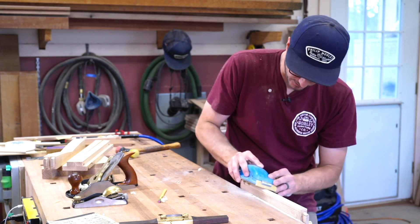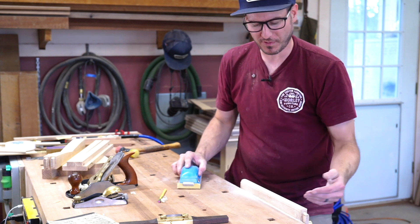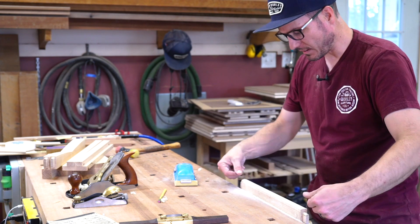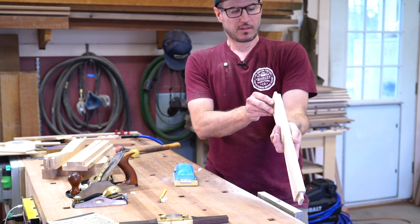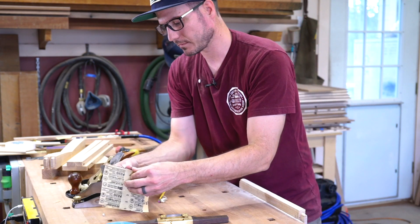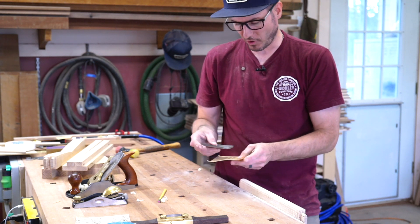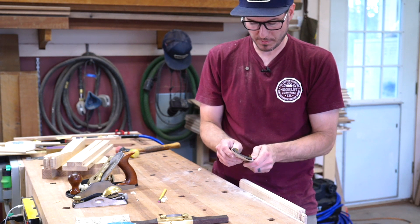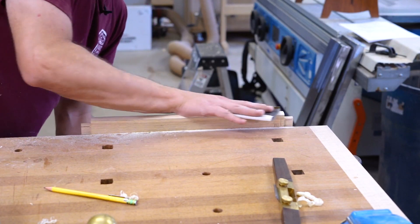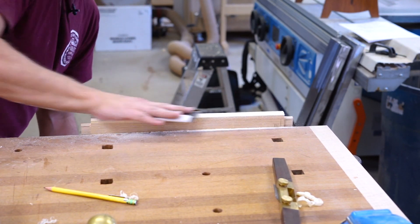Keep in mind you'll never be able to run your eye down this edge when it's in the piece. What you'll see is when it's up against the wall — that's what you'll see. So make sure you make these nice and consistent. Moving on to 180 grit. I usually use a piece of cardboard; this is some kind of medium-density foam that will do the same job. Come through here and get all those facets blended in, maintaining that crisp edge too.